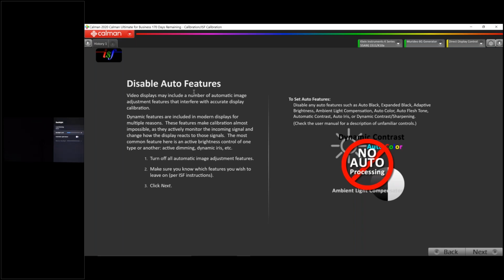The backlight we had fairly low at about 25. Remember, dark room, you don't want to have it so bright that it hurts. We're going to aim for probably a little over 100 nits. Remember, the reference is 100, but again, that's a completely dark studio environment.